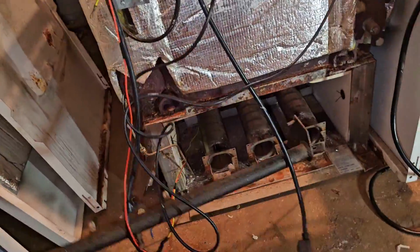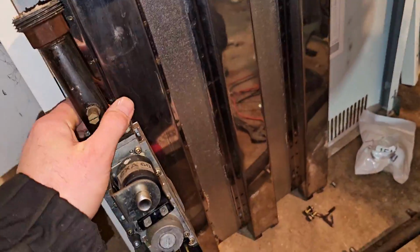There we go. One gas valve for the swapping. So as I'm undoing this pilot on this one to swap the gas valves over, what's just dawned on me is something I definitely should have checked. What about if when the main burner's coming on, it was just taking the gas away from the pilot? As soon as the main burner opens, it was taking the gas away from the pilot, it went out. Could have been that, and I didn't check it. So if I swap this over, and the fault stays on that boiler, that's what I'll check. If the fault moves to this boiler, that is also what I will check, rather than it being the gas valve, because they measure out so close. But I should have checked that. That would save me a lot of messing about.